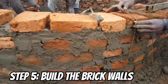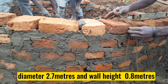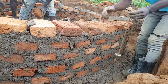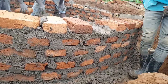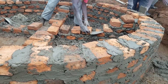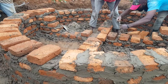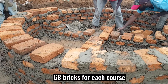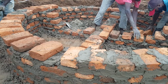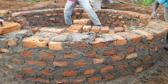The fifth step is to build the walls. The diameter of the walls will be 2.7 meters and the height will be 0.8 meters. We used a header bond of wall thickness 230 millimeters. Mortar mix for brick walling is 1:4, that is 1 part cement and 4 parts sand. We used exactly 3 bags of cement. We used 68 bricks per course, and for 8 courses, a total of 544 bricks. When ordering, add extras.